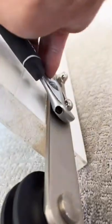Your next step is just making sure these hangers are level as well. And once everything's nice and tight and level, obviously, you can put the rollers on the track. Oh, and don't forget about these anti-jump blocks. They fill the void between the track and the door. That way the door doesn't bounce off.